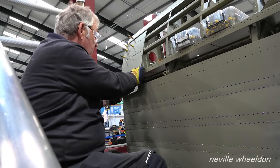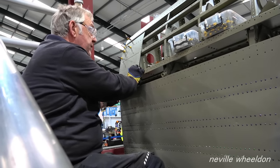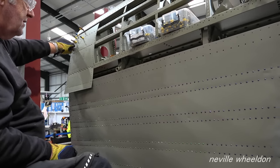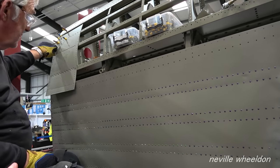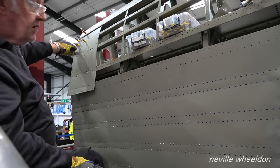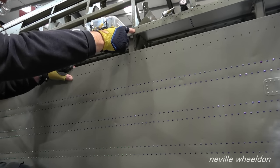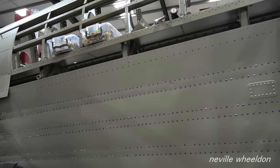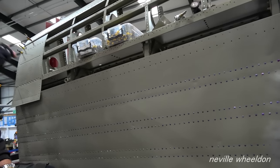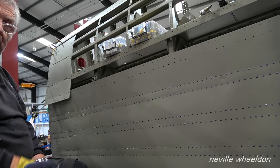Discussion about riveting on the ribs — rib 22 isn't done yet. The plug rivets are screwed: every intersection of the panel has got screws in it, because where the two panels join they put a screw in. There are screws underneath where the engine point is, then plug rivets, and then at the root end it's all screws — there are rows of them.